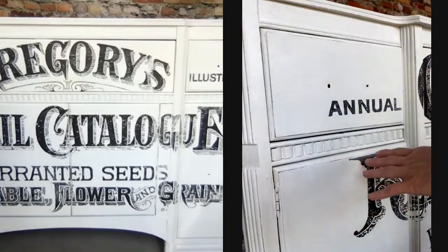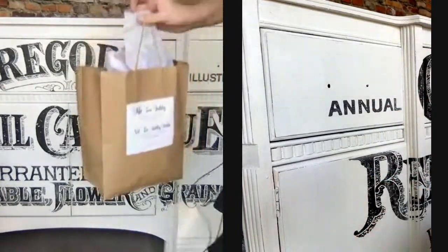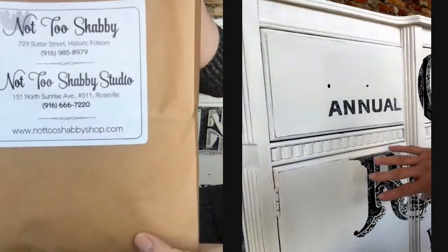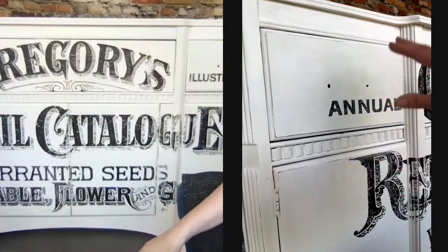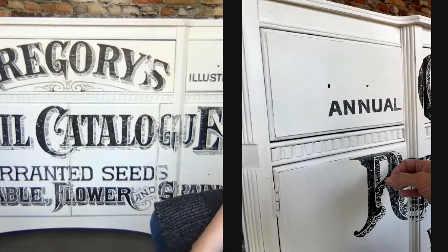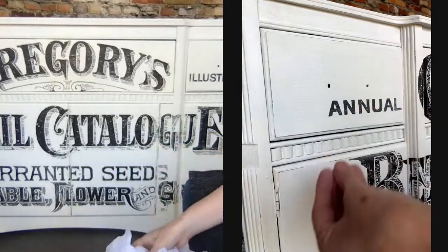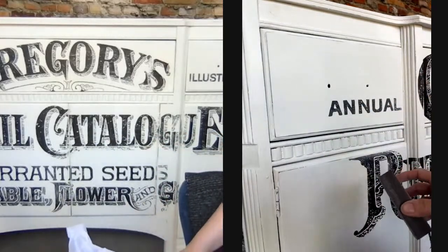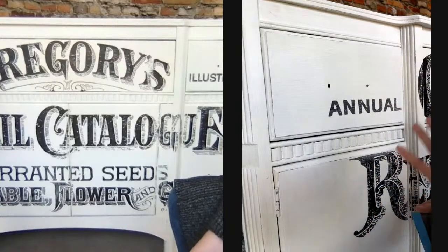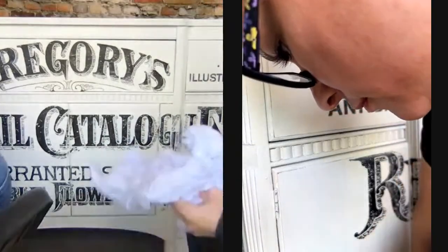Now, we touched on the fact that we applied two sprayed on coats of sealer on this, but it's worth repeating that having those sprayed on coats be thoroughly on and thoroughly dry, so you're encapsulating your pigment, especially when you're dealing with really dark and or particularly dense pigment, which our inlays have very dense pigment. You want that encapsulated so that, unless you're doing something where you want it to stay active, you can sand it and wipe it without pigment migration. It's very, very important.